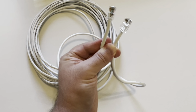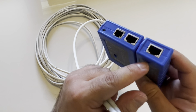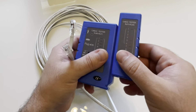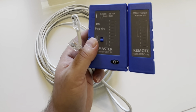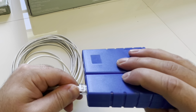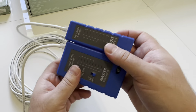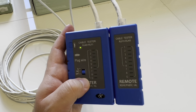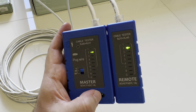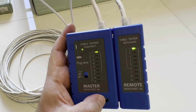This looks good, but now we need to make sure it's actually good, and to do that we're going to use the cable tester. There are multiple ports on it and it can basically slide apart — that would be useful if there's a cable end on each side of a wall, for example. To use it, plug one end of the cable into the receiving end of the tester and the other end into the transmitter end, then hit the switch. You'll see the LEDs going through numbers 1 through 8, which tells us there is a connection between each of the pins on both ends of the cable — the cable is good. You can slow it down by moving the switch to the S position. This means the cable is good.